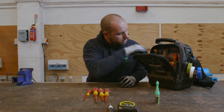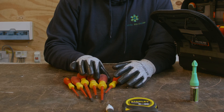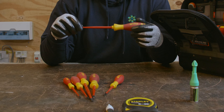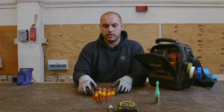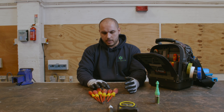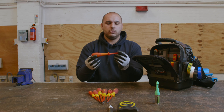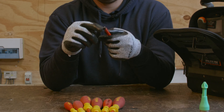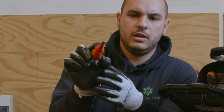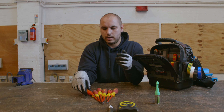In this section, I've got a selection of different ones — these are all VDE screwdrivers, rated to 1,000 volts. These are insulated as well, so obviously these protect you whilst doing the job. Electrician screwdrivers in various different sizes — we've got slotted, PZ2, PZ1, and so on. Another good one I would highly recommend is this CK one — it's a modular screwdriver. It's slightly different — it's not like a positive screwdriver, it's got a slotted area as well. That is a really good screwdriver for when you're tightening up terminations in consumer units and that kind of stuff.